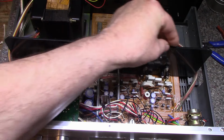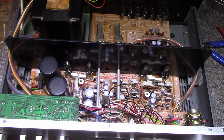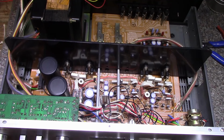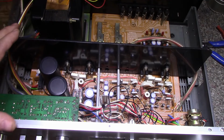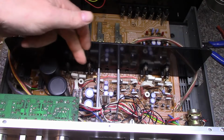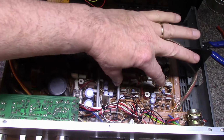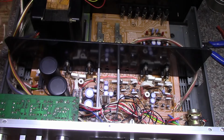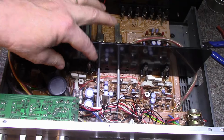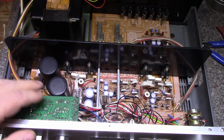We've got a big aluminum plate here in the center, and we have 4 transistors, 2 on each side. What else do we have here? We've got a big board. I'm assuming it's one large board, with everything on the one board. We've got our power supply and circuit protector here, and then our power amplifier stuff going on here and here. Tucked underneath, you're going to see all our tone. We have a tone board here. This is our bass and treble control with our tone defeat switches and our hinges, so that's all up here.